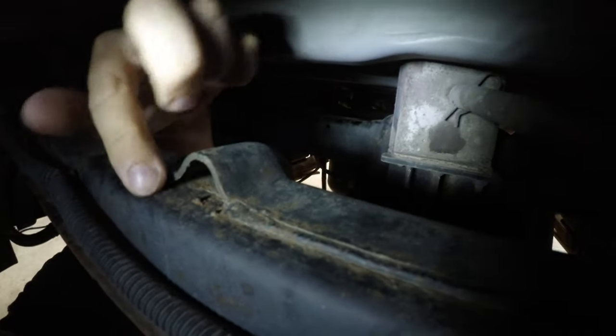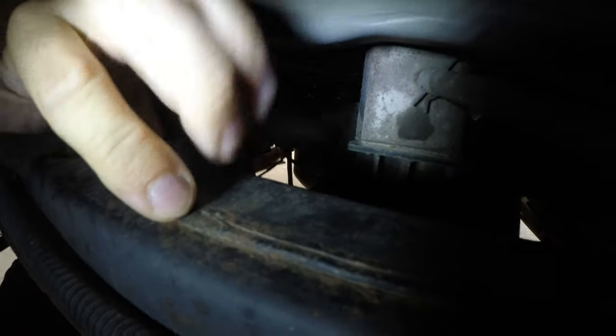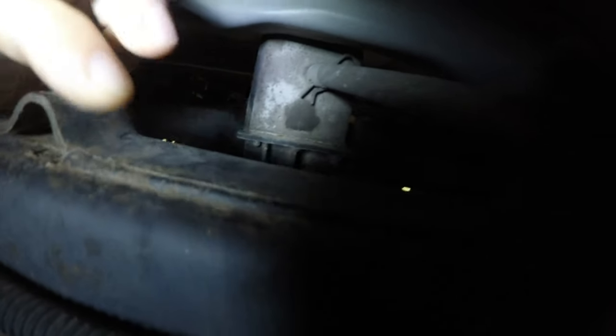Let me get you a nice picture of what I'm looking at. You can see it's welded there and then open on the sides, so I just have to cut this weld out on both sides - it gets kind of deep - and then hopefully just bang it with a hammer a couple times and it'll come right out. That way if I ever need to I can weld it back in no problems.